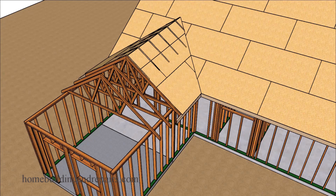As someone who has done a lot of room additions, I can tell you it's only a matter of time before you run into this problem. Especially if you check the roof and see that it's a 5 and 12 pitch and you order 5 and 12 roof trusses, only to find out that the roof truss company didn't make your trusses exactly 5 and 12, or that the existing roof isn't built with an exact 5 and 12 pitch either.